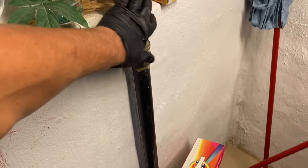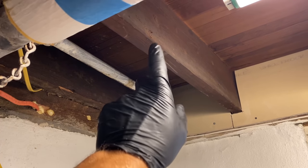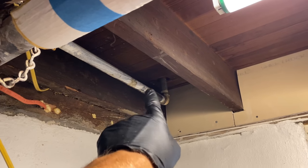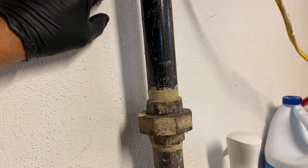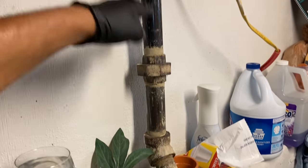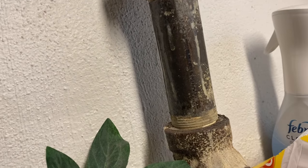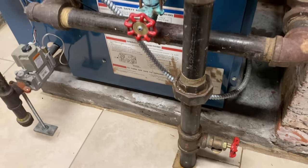All right, after talking to the client, the homeowner, the radiator that's there sometimes spits water out of the steam radiator air valve, and also the one in the front of the house does the same thing. And that is a clear indication of a clogged wet return. So the solution here is we have to take this apart, this inch and a quarter piping, I'm almost positive, and put in a valve, a T with a boiler drain, and put this back together. I think that's inch and a quarter. And on the other side, in 1 inch, we have to do the same thing. And then at the boiler, just hope that we'll be all right, because ideally a valve here, and we could force water through the system.